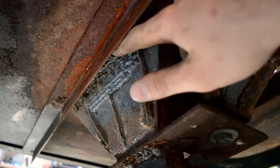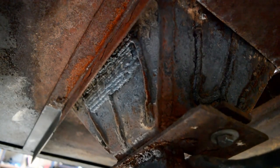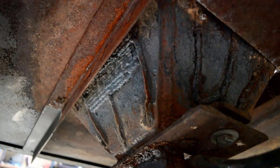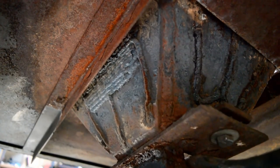This is the bottom view of the fire pot. You can see it's attached to the air assembly by two bolts, and also on the side you can see I padded it up with weld because the fire pot — although I started with a half inch — burned down to three-eighths, so I padded it up to half inch in some places, and in the most used places I padded it up to five-eighths of an inch, so that should make it last a lot longer.